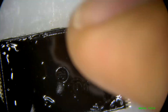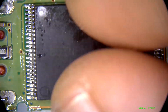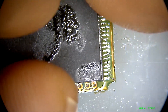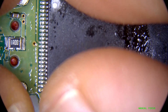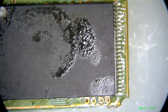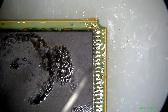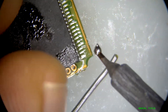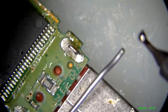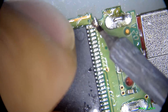All right, that's good to go. Because the extra flux is still in very liquid form, I don't really see any need to clean it off. We're going to position the chip precisely so that all legs line up with the pads of this PCB, and then anchor it in a couple of positions on the outside pins just to make sure it sits straight and doesn't move anymore.